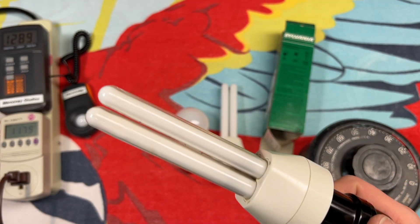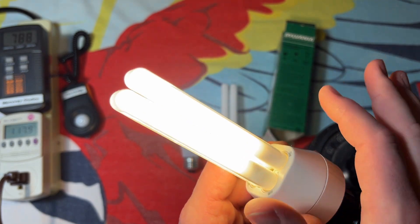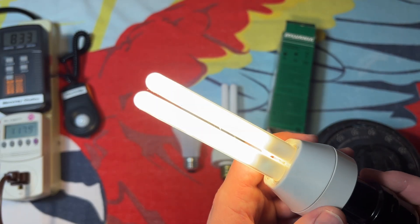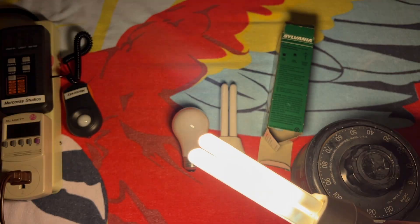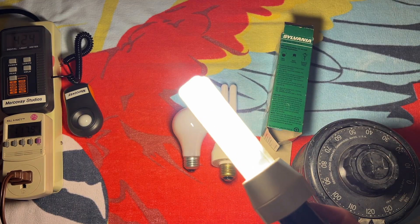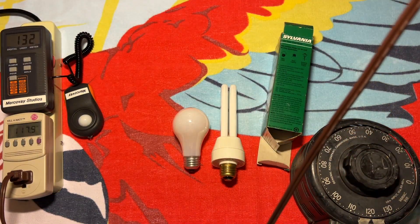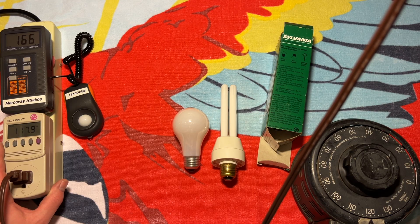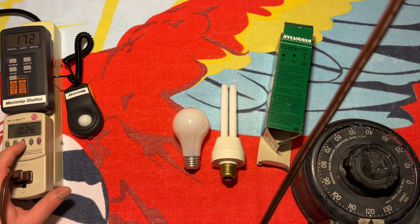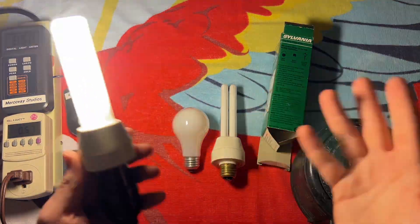Now watch these electrodes here. That wasn't too much of a show this time. When I turned it on after getting them from the thrift store it had a nice big blue show there at the bottom, because it has some heavy blackening there at the bottom of the arc tube. We can see the mercury discharge in our little weld there. The camera's not picking it up too well but it is blue. This is a full mercury content bulb so we don't really need to wait long for this to get to full brightness — in fact I'd say it's already there, because we weren't worried about those things at the time. So I'm going to hold this up at our two foot mark here. We're getting about 155 lux. This particular used bulb at 117.9 volts is giving us 0.26 amps, 17.4 watts, and a power factor of 0.57. So that is our used bulb.